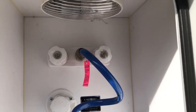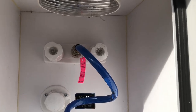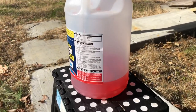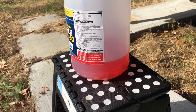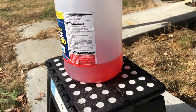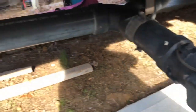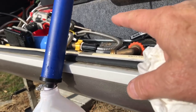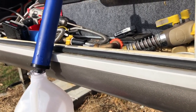One thing to make sure you don't forget: if your trailer or RV has an outside shower or outside faucet, make sure to include it when you do your winterization. This is how much antifreeze I have left, so I'm going to split this evenly between the black tank and the gray water tank. That protects these gate valves — that water pools down close to those gate valves and protects them from freezing.